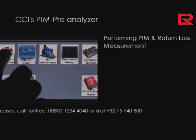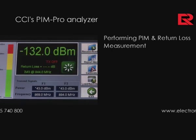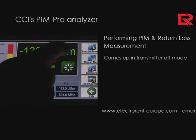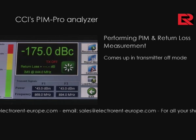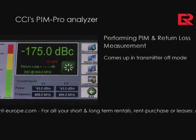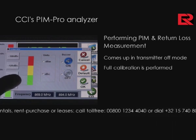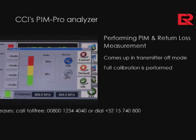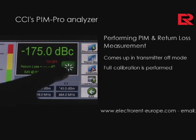So now I'll perform a PIM and return loss measurement, and as you can see from the screen, the measurement comes up in a transmitter off condition. When you first turn on the transmitter, the RF power, it performs a full calibration procedure. This is roughly a 10 to 15 second procedure. It calibrates both tones, both transmitter tones.